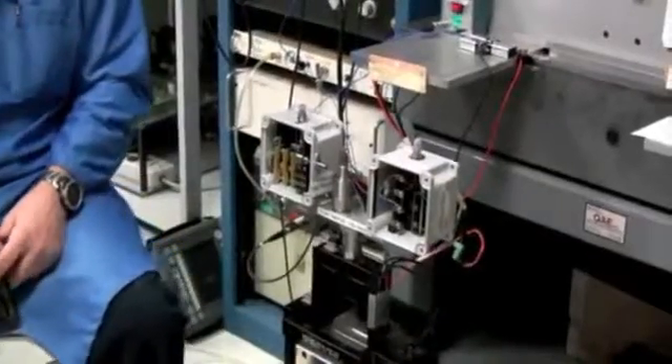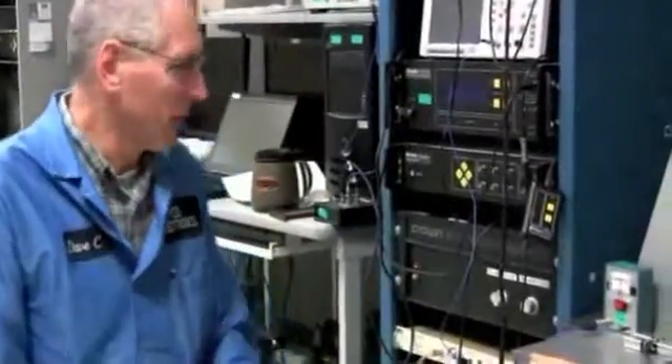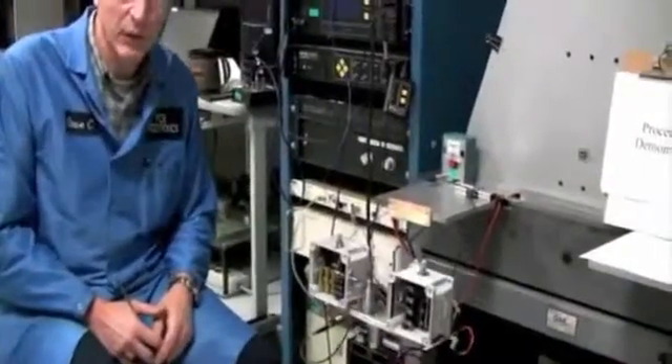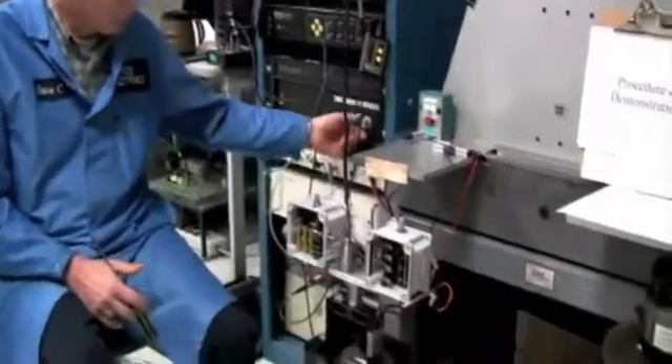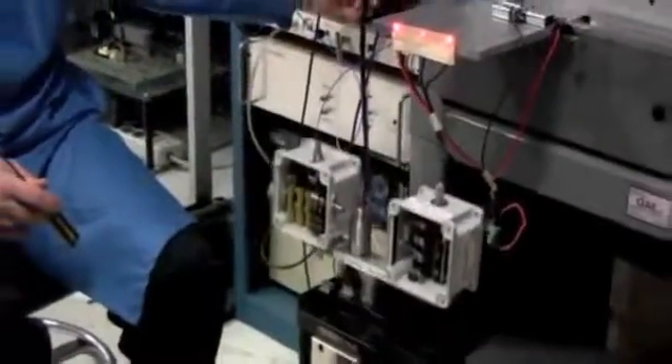You can see right away it's the electronic switch that tripped immediately when it reached 0.7 inches per second, which is about 30 or 40 mils of displacement. Let's continue on up and see if at this frequency a pure unbalanced condition could get high enough to trip the remaining switches. The linear adjust switch did trip, but we still haven't tripped the traditional switch. Moving up further — we still don't have enough vibration there. Finally we tripped it when we started hitting.